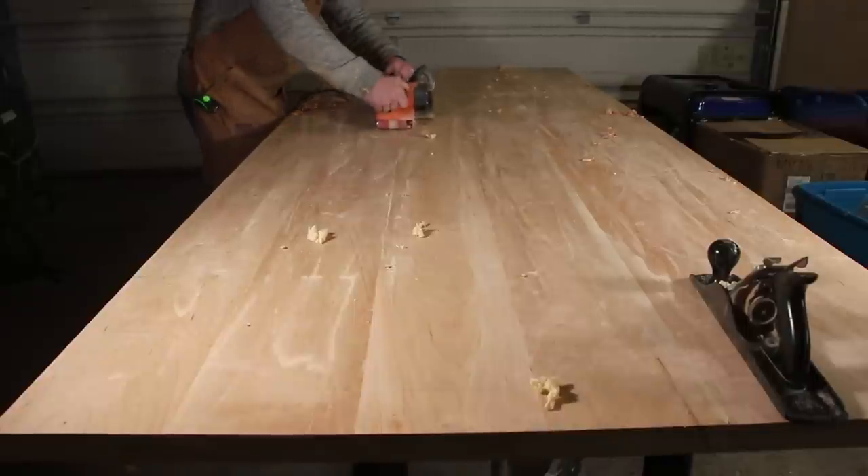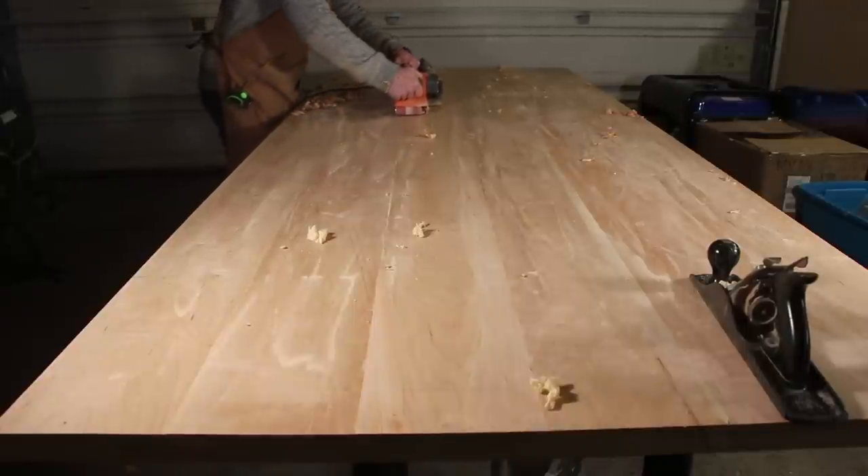It was smoothing out some of the high spots, but it was making it so I had to do another step to go back and sand to clean up the sander marks. Even with a light grit, belt sanders take off a lot of material and they're kind of hard to control. They gouge, they move, they bite. Unless you're trying to sand a quarter inch off of something and you want it to eat up material, that may work. Otherwise, it's not a good idea.